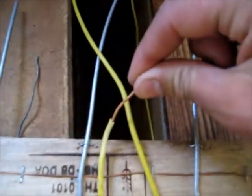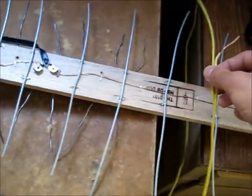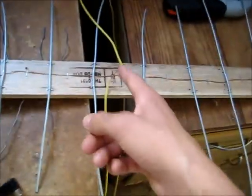If you look at how a little TV antenna is constructed, depending on where you live, they have a loop in the middle. One end is connected to this, and there's a ground from the shield or sometimes it's connected to the ground of the antenna, but other times it's not — it just has this connected and that's it. Your centre bit connects to that in the middle. If it's reflected off here, this will capture it in the middle. So I'll change this over and we'll staple it down and give it a test.